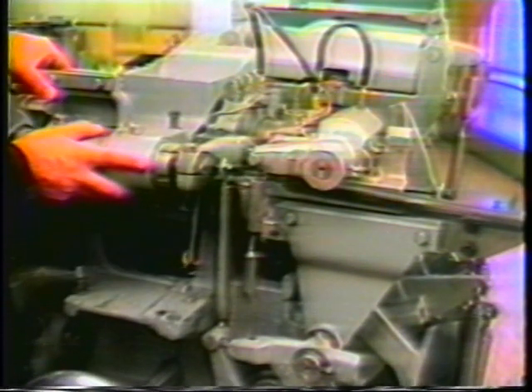Advance the machine to the point where the burring spindle approaches the countersink. This is the position on the burring spindle cam immediately after the drop after cutoff. At this point the countersink arm should be down. The countersink attachment should be installed on the machine only after the workpiece is complete through the fifth position and the burring spindle is properly set.